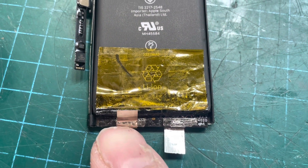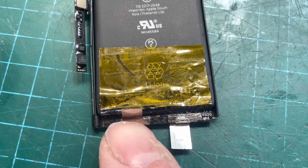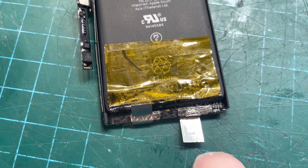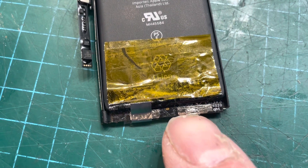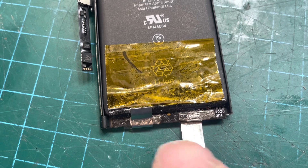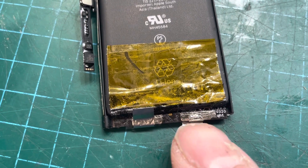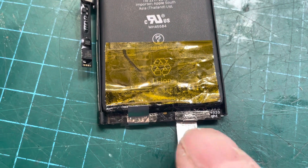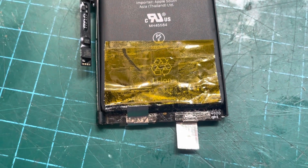I like to do a little trick — I cut off the nickel from the battery tab, and then you'll need that little piece you cut off to place on the aluminium tab on top, so that you can spot weld through the aluminium. If you don't do that you find it very difficult to spot weld the aluminium — it just kind of blows up in your face. So a little trick for you.